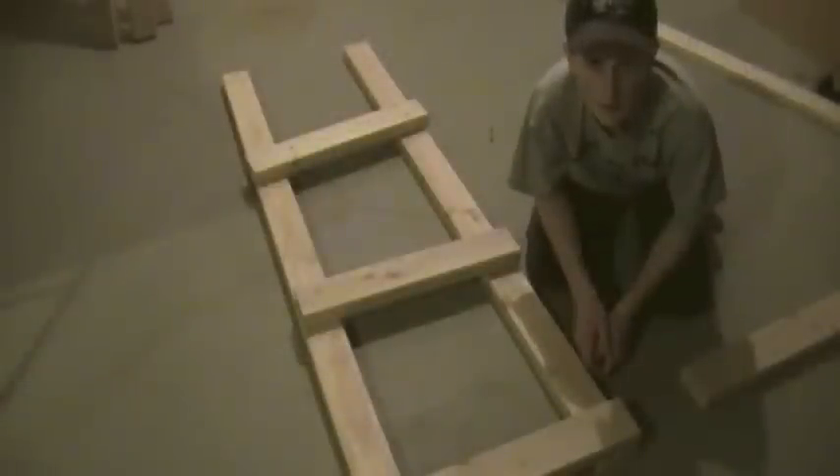So it's going to clear by about a half an inch. What you want to do is take your framing square, measure up 21 inches, and then come down 3 and a half inches. Make sure these are all nice and square, then mark it off, and do that three times. Then go from that line up 21 inches, then 21 inches down 3 and a half inches, and align those on both sides. Use your framing square or speed triangle when you're ready to screw it in. Apply some glue and pop it down. I have these beefy 3-inch screws to go almost completely through the wood to make sure it's a good solid connection. Now I will assemble all of this.